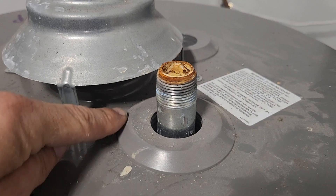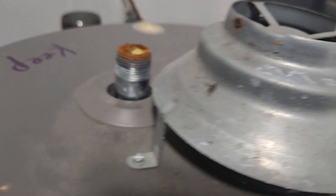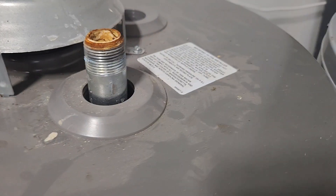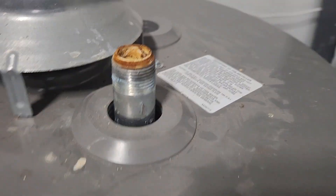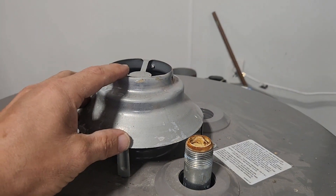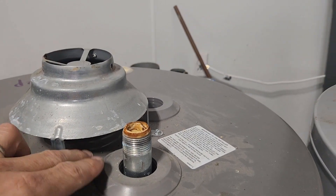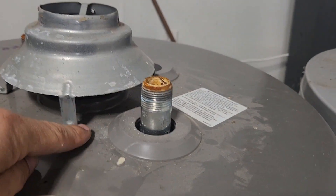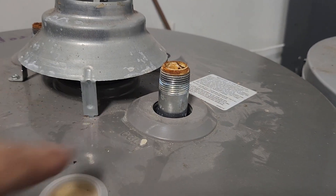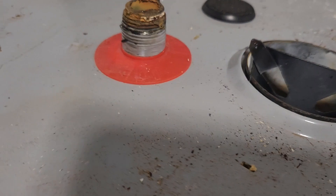This little plastic collar around this pipe — you see there's one there and there's one there as well. This plastic collar is not melted or deformed in any way. Now what can happen is if the exhaust is not flued properly, some of the heat from the heater can escape out of the side and all that heat starts to melt this plastic. Look, there's another one — plastic is in good shape.